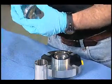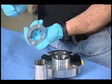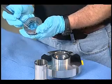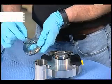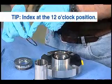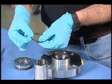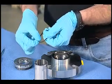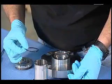As you pull this apart you're going to have more parts. What you can do is index and bag those as you go. For example, I've got a little o-ring in here — I'm going to very carefully take that out. Right when I take it out, because you can't really mark an o-ring without damaging it permanently, what I'm going to do is hold it where that index mark is. So I know where this was, and I can go back in my report and say everything indexed at the 12 o'clock position. Now when I'm looking at this o-ring I know this is the 12 o'clock position. If maybe there's wear or corrosion just in one part of the o-ring, I can now document where it was relative to everything else in the sleeve. You're never going to have a chance to do this again once you've taken a seal apart — this evidence is essentially lost. I'm teaching you how to capture it. This was part number 15.